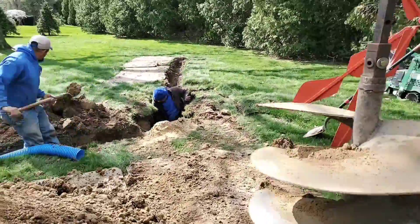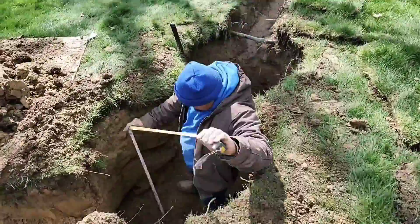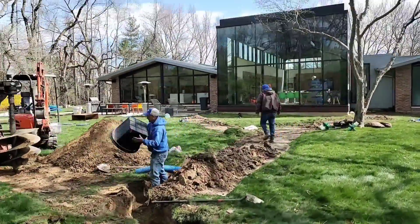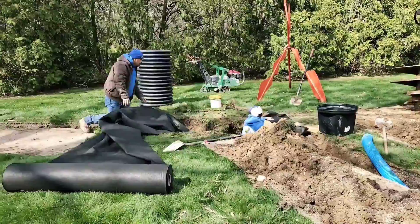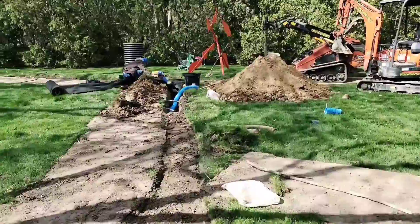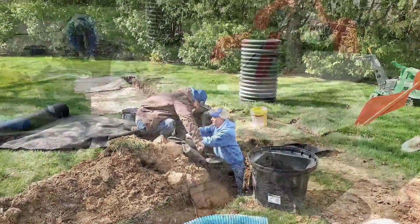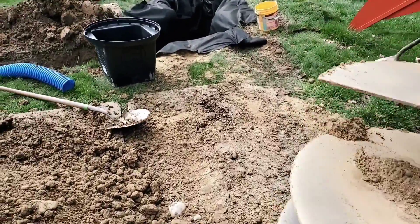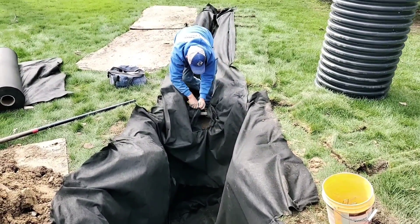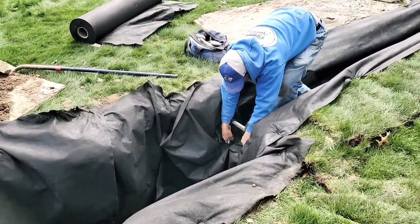Where the trees are in the back — the evergreen trees, the real tall hedge of arborvitae — that's the lowest point. Notice how the soak away is far away from the house so we're not close to the foundation. I don't want this water to wick back through the soil through capillary action to the foundation. I don't want to be in the lowest point of the yard. That is not where you want to put your soak away or dry well. If you do that, you've made one of the biggest mistakes.